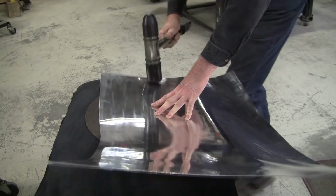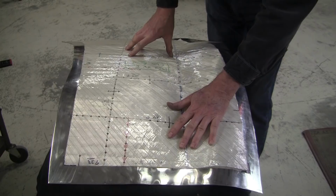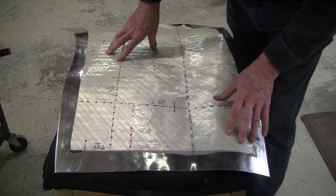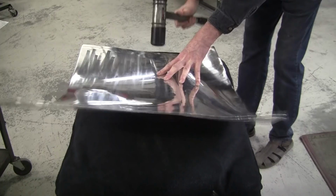and then check it. And it's no different than if you were reading a blueprint on a lathe and you're checking the diameter on a shaft and you have to cut 80 thousandths more off, you don't cut 80 thousandths in one go. You do it a little bit at a time. So yeah, you can see there's a little motion right there. That's where I got to come up some more. So I'm going to tiptoe to the finish line here. I don't want to go too fast, just like cutting on a lathe. Cut some nice little 30 thousandths cuts rather than a heavy cut.